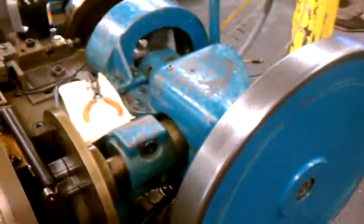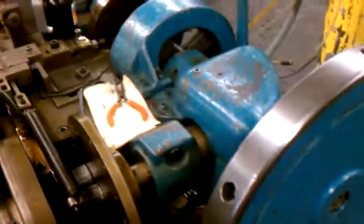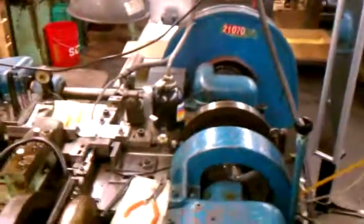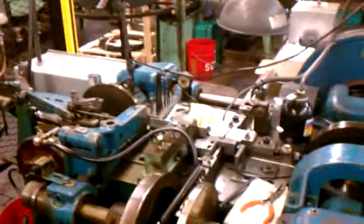There's the flywheel — it stops instantly. You don't always want to stop it like that when you're running it. So what we have on here is the coast to stop, where it slows it down much gentler so you're not shocking the machine in the non-emergency situation.